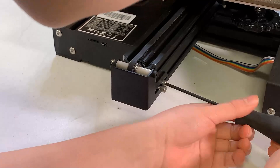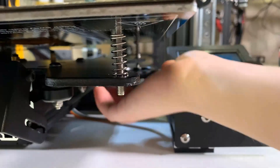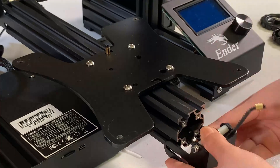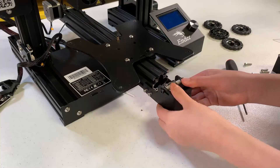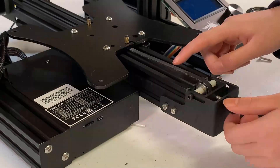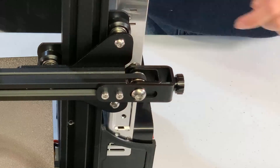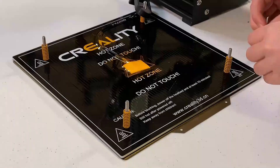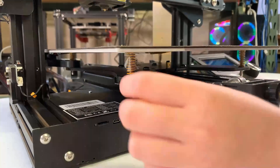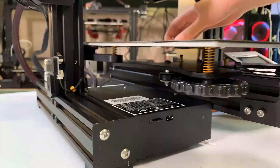The y-axis is pretty much the same. Remove the existing tensioner. Removing the heated bed first will make it easier to unlock the belt, since we also need to replace the spring later on. Attach the new tensioner, let the belt go around it, and lock it back to the print bed. Now we can adjust the tension by turning the knob — it's much easier and more accurate. We will install the new springs for the bed. Use some tape to secure the springs to make it easier to put back. Remove the tape once the screws are aligned, then put the wheels back. You may need to apply some extra pressure to let the spring push against the bed to make it completely tight.